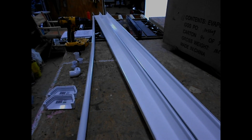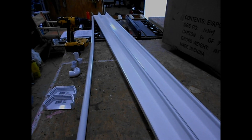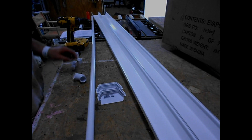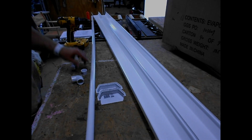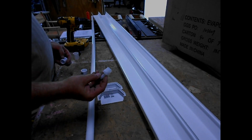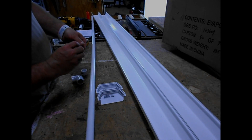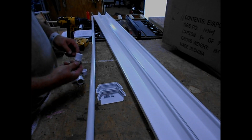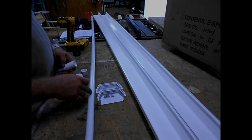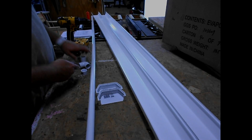The supplies I've got: two rain gutters, ten-footers from Lowe's, two end caps, three-quarter PVC pipe, three-quarter elbow, three-quarter cap, and a barbed fitting that'll go on my hose off my water pump and screw into a three-quarter coupling. So when I elbow down I'll just run a three-quarter piece down, put the coupling on there — I'll show you how it all goes together in a bit.